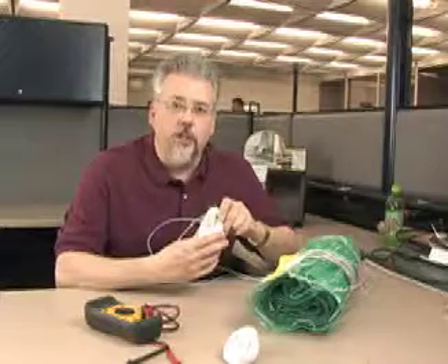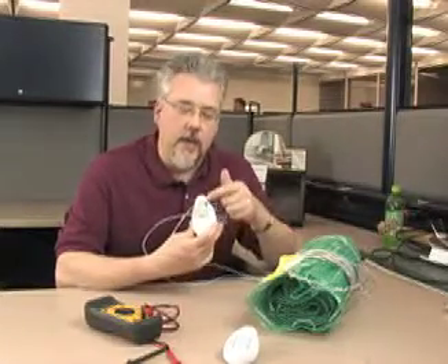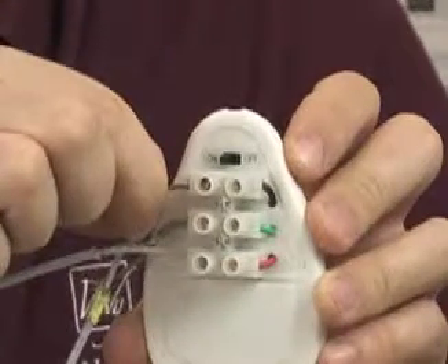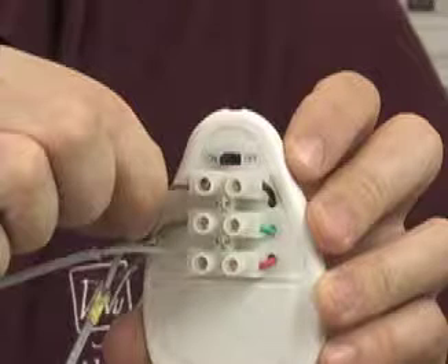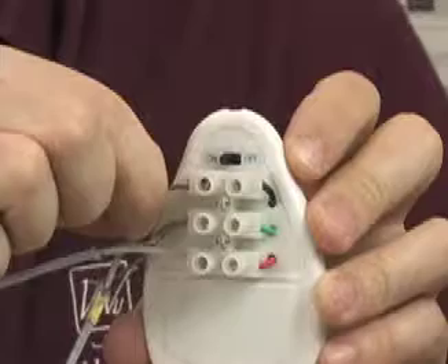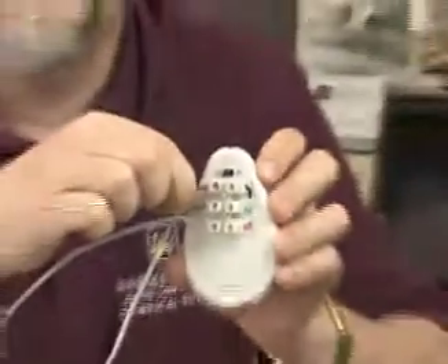When you use the circuit check, you'll see it has three wires or three connections to be made. There's a red, a black, and a green wire. These correspond to the sections of wire you're going to install into them. The red and black wires will accept the center cores from each of your cold leads. Then we tie together the braided shields, which are the outer part of the wire, and put them into the green section.